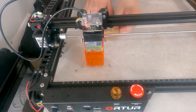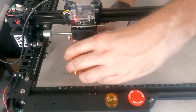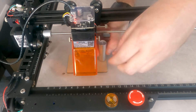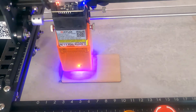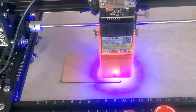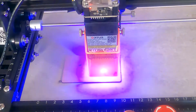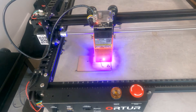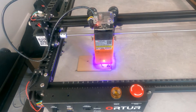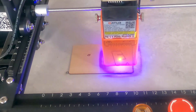I've got another credit card size bit of ply, and this time I'm going to try cutting it out. First I need to refocus to ensure it's at the right height using the little metal bar, then switch on the laser and confirm I'm right in the center. I'll set it running — now it's cutting out. I'm leaving it running at normal speed so you can get an idea of how long it takes. It's moving pretty quickly considering it is actually cutting through this wood, which I think is really impressive. I have left the room this time, and we're now running at about 250% speed.